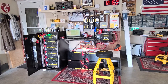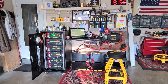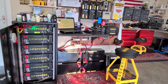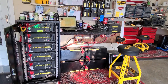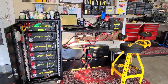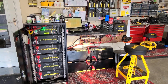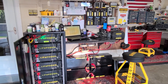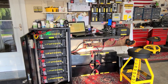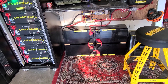Hopefully this inspires you with your own solar setup. This is a grid-assist off-grid kind of system — I don't sell back power, I just store and use it. It's great for power outages and for running autonomously: when the batteries get too low the Outback switches back to grid power. It works like a refrigerator or a stove — you just expect it to work every single time. Thanks for watching.